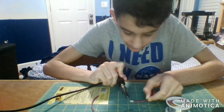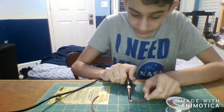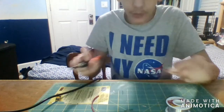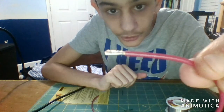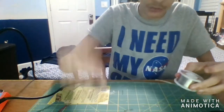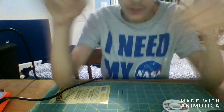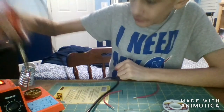There are multiple ways of actually getting the solder onto the wire. Let me turn up the temperature a little bit — I'll put the temperature on screen. Now that all your solder is on, normally you'd want to get a better coat than this, but this is being particularly difficult. Next thing you're going to want to do once you're done tinning your wires is clean your soldering iron tip. What you do is just fist it a few times in the tip cleaner until the tip looks clean, then rub it on the sponge.